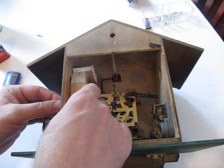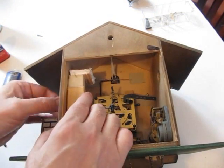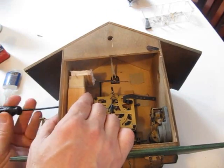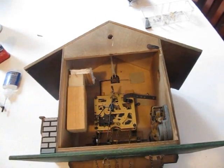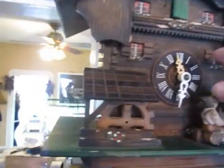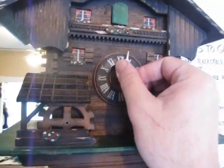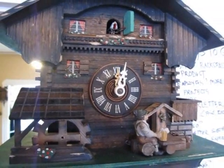We are going to put the bellows back in. If you notice there is a little lever on the top of that bellows — here it goes horizontal. The little wire goes horizontal off that bellows, and that actually kicks the cuckoo's tail up to make him tilt forward. That way the cuckoo tilts when he comes out of the little cuckoo door. They are not as strong as I want them to be but I can actually tweak it a little bit. Even his little mouth opens when he cuckoos.